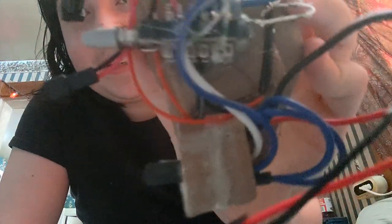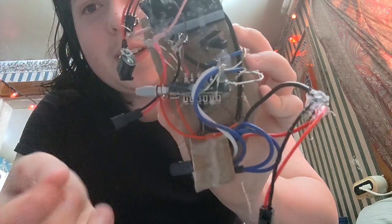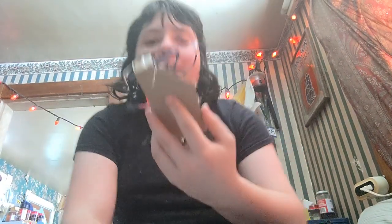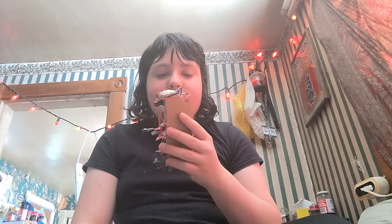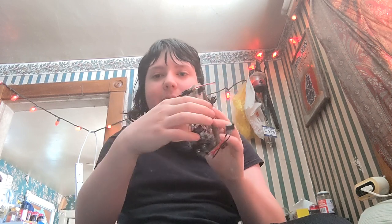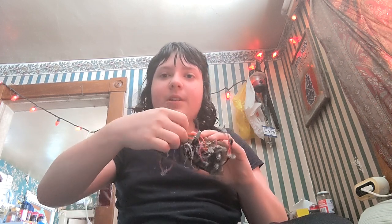I added a second piece of cardboard — the old one is still there, you can still kind of see it — but I put on a bigger one so it had a little more coverage over the wires hanging off the sides. The polarity switch uses all this space because it's so big. I was planning on putting it over the diode bridge, which is underneath this switch, but after I put that switch there, there was no room, so I had to make room. The polarity switch comes after this switch, just in case you're running DC into it and have it on AC mode — you could still switch the polarity even on AC mode.